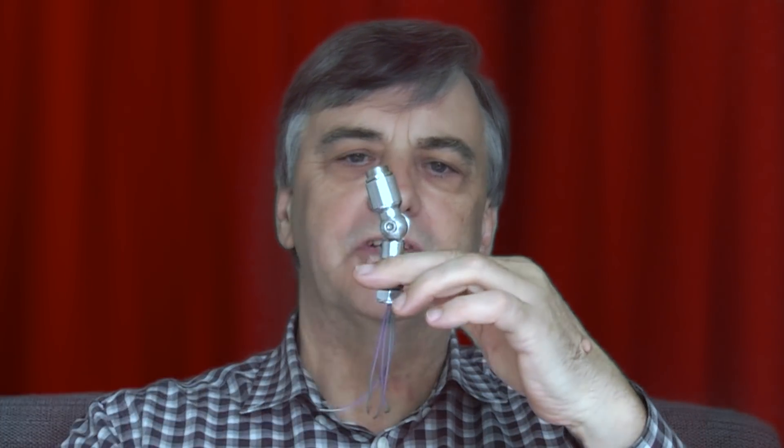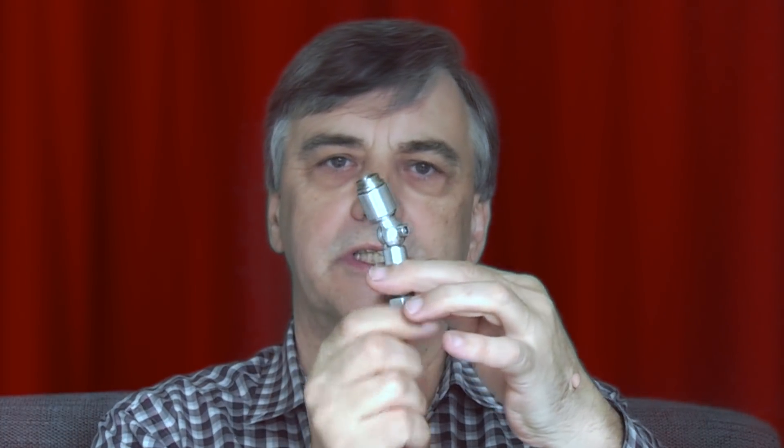This is what it looks like. In this end there's a socket. The wires come out on the bottom. This will go into the base of the rotary head and bolt in from underneath, and then this will swivel 180 degrees on the top and 360 degrees around, so I can connect the cable to the rotary head without the cable coming near the cutting tool or any coolant.